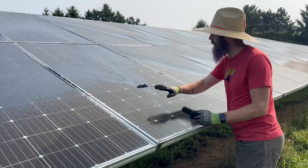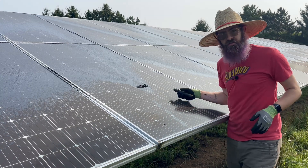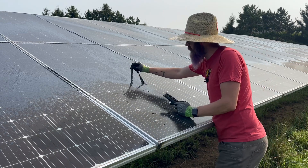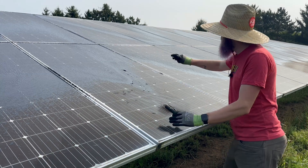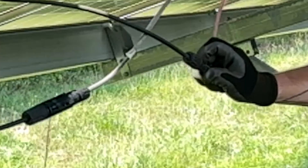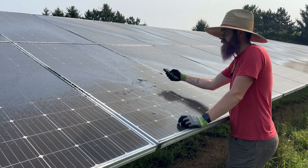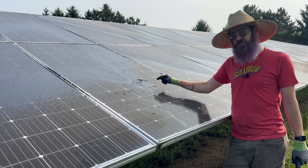Now that I've gotten farther down to the place where I was just spraying a strip along the middle really fast — to see how little I could get away with — I'm starting to experience the consequence of my actions. There's going to be a lot of splatters here, which you can't peel off; you have to scrape off and come back through with a vacuum to get all the little bits. The parts that aren't coated well are simply not going to peel off because there's not enough to them. This coating is way below the 40% that PV Stop recommends, and you definitely want to put on more than just this — not just for the safety aspect, but for the cleanup aspect. PV Stop also recommends going back through and aiming for 100% coverage, and this is a good reason why.